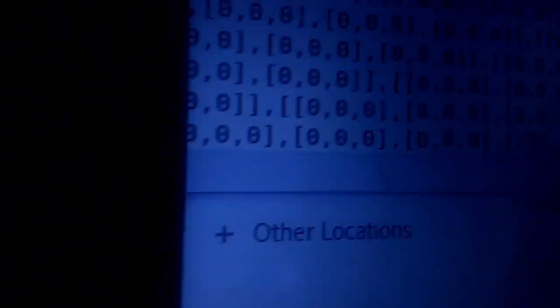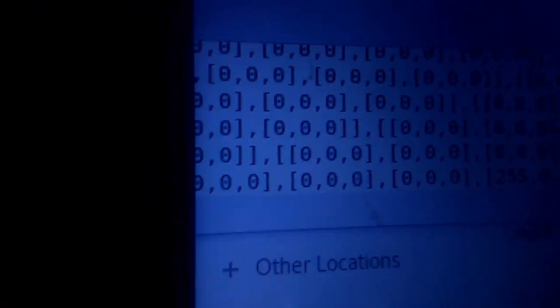And if you look over here, my light show files are a JSON serialized object, or really just an array. Each item in the array is an array, which is like a frame, and each item inside of that is one row, and inside of that is each pixel in that row, and inside of that are the red, green, and blue. The reason I can do red, green, and blue is because the people that made MIDI figured people might want to use this protocol for things they might not think of back in the 1980s, 1970s. So they had the brilliant idea of adding system-exclusive messages, which have a certain header and a certain footer, but it's just a list of bytes, and whatever a device says they are, you can use them that way.